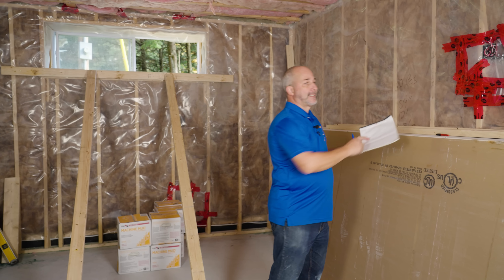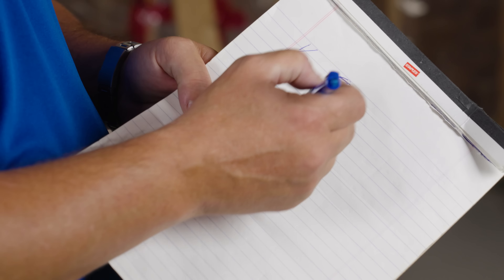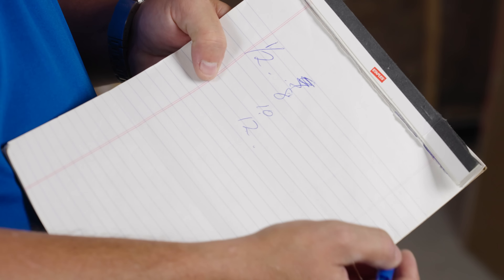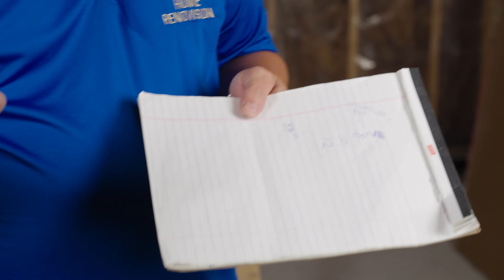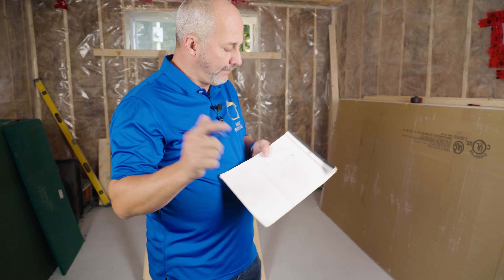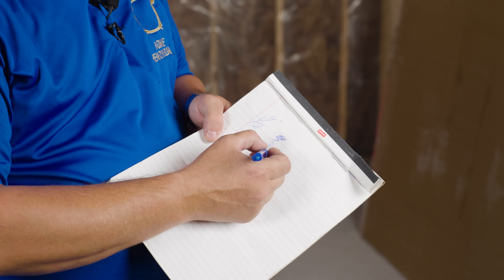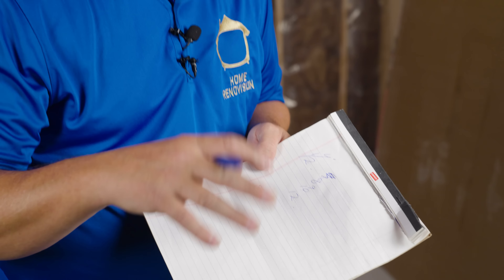The way it works is really simple. My system: I'll start with half-inch drywall and put down 8, 10, and 12 — those are the three different length options. Generally speaking, regular half-inch drywall comes four feet wide. Now there's also the 54-inch option, which is not something most folks who shop at Home Depot are going to be familiar with because 54-inch is not sold there — they kind of stick to the real simples. Most Home Depots sell only half-inch: eights, some nines, 10s and 12s, and in a lot of cases a five-eighths fire rated but only the eight-footers. They're limited because they're in an aisle warehouse, which leaves people thinking those are the only options.